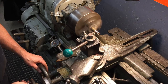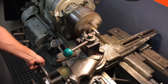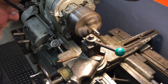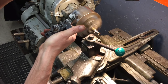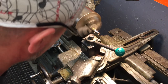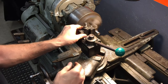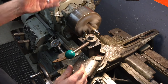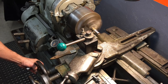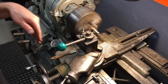Just to make it look nice, we return this surface — like that. This is the tool we were using; I don't remember what it is called anymore, but there is your carbide insert and that is our tool holder. This is a parting tool. Because this operation, we are parting the part off of our stock. This only has to be eyeballed. I just need some material on there so that when I press this bushing into the hinge, it doesn't fall all the way through.